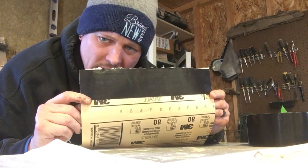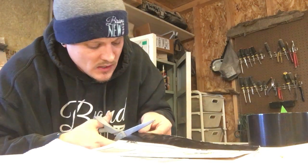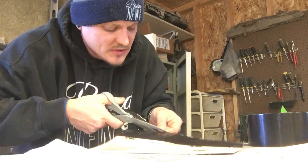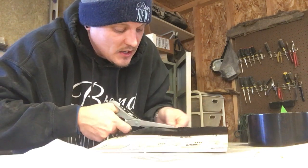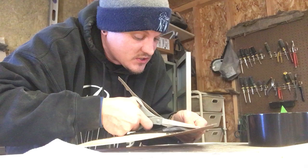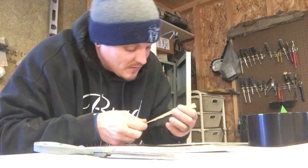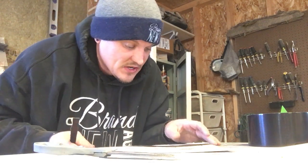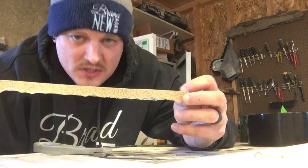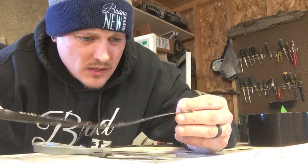What I do is take a roll of duct tape and put it on the back of the sandpaper. The reason I do that is to strengthen it up. Then I take scissors and cut thin strips down the back. The thickness of your strips basically depends on how tight an area you're trying to sand — if you've got really narrow crevices, cut it thin; if you've got larger spindles and want to maximize surface area, you can cut it wider. You're left with a little thin strip of sandpaper with duct tape on the back.